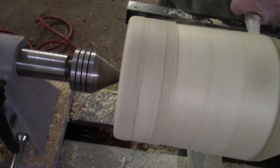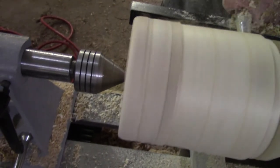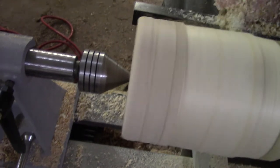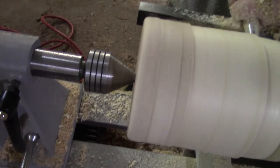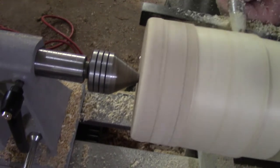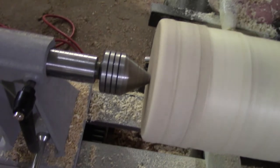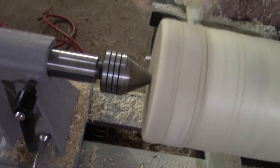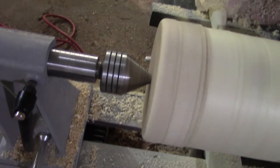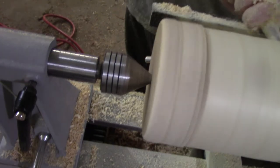I made this basically out of spruce. I used some old two-by-sixes and eights, and I took some two-by-two ends that I had kicked around and cut them down to an inch and a quarter square, then cut them in half. I took them over to my segment sled and cut the segments, so they're about an inch and a quarter tall each segment ring.